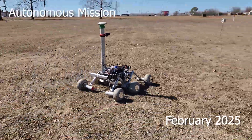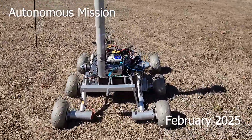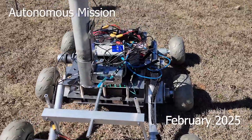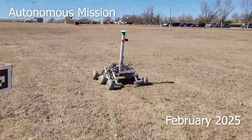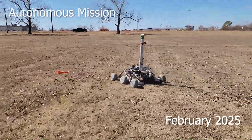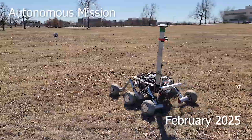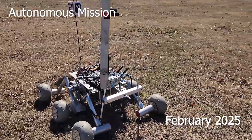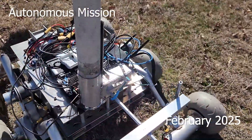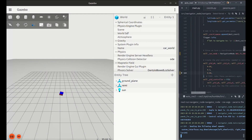Navigation to GNSS coordinates is managed by a PID controller, continuously adjusting the rover's bearing for precise movement. As the rover encounters obstacles, real-time sensor input allows the navigator node to adjust wheel speeds and avoid collisions. ArUco tag tracking begins with image capture using an Econ Systems C3Cam24CUG camera with OpenCV-based adaptive thresholding, ensuring reliable detection in varying light. The rover dynamically adjusts its heading based on detected tags, initiating a search algorithm if no marker is found.